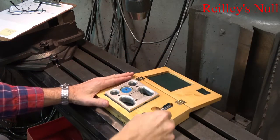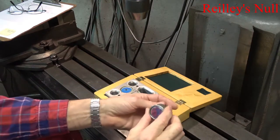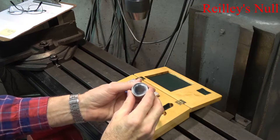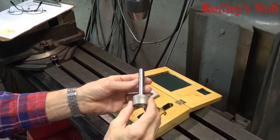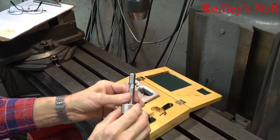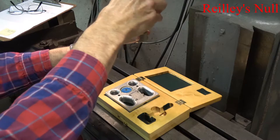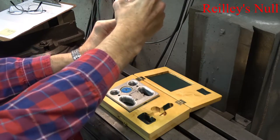There are two parts to it. One is a target mirror, which is a regular surface-reflecting mirror mounted on the shaft where the mirror is quite precisely perpendicular to the axis of the shaft. And that will go in the spindle.